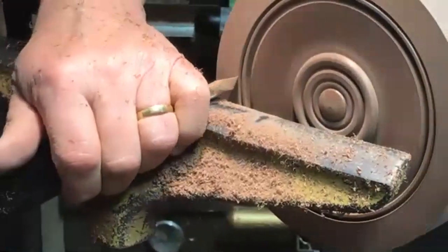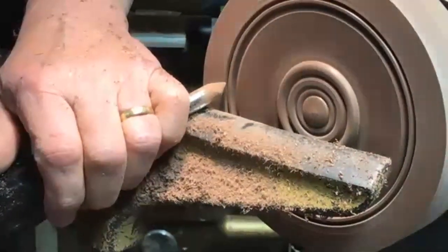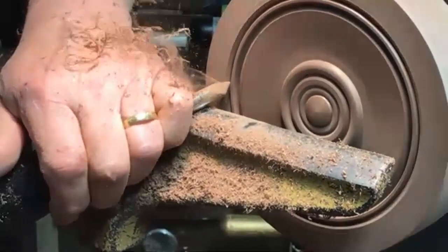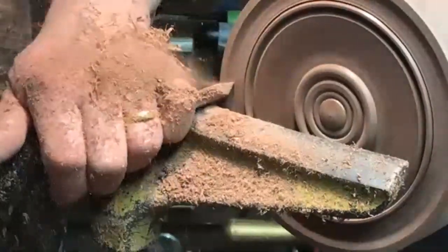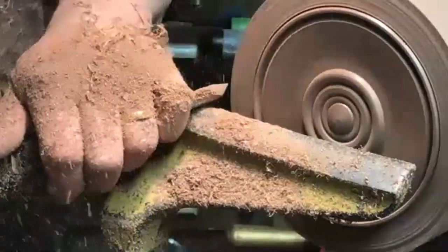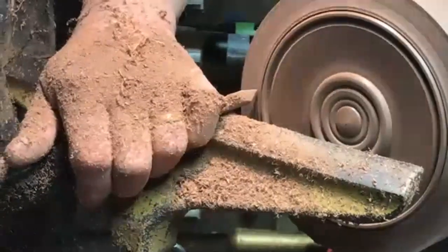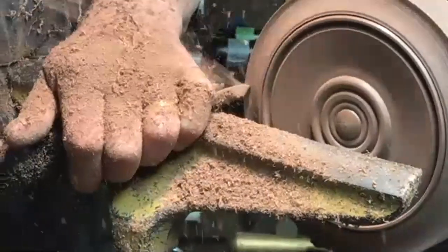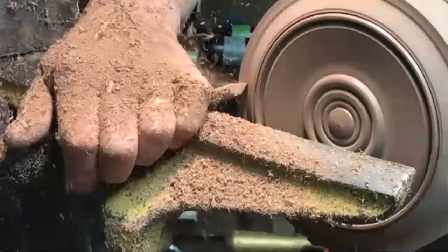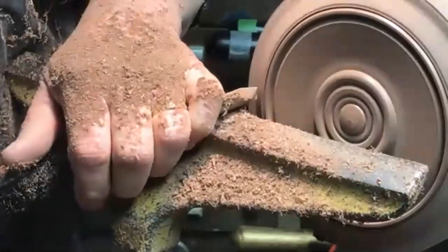The design just goes with whatever you can come up with. If they're not the same on both sides, don't worry too much. Here comes that peel cut again - I'm going to start with the bevel rubbing on that small bead, rotate it to about 11 o'clock, and peel cut, pulling the tool toward me. Now I'm down to a little less than a half inch - seven-sixteenths - depending on how much of that you want to show.